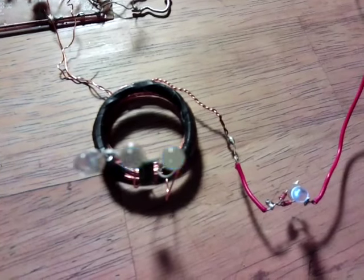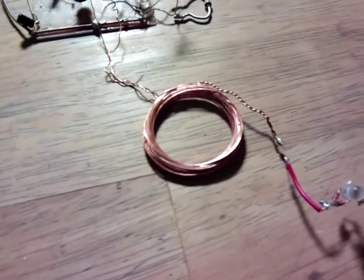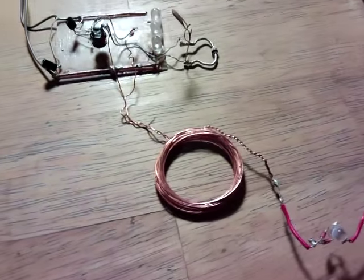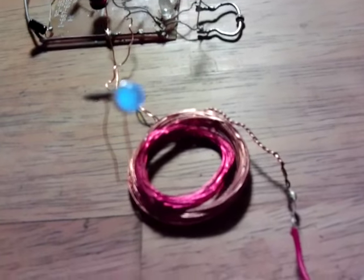It looks like a solid light, and that one brightens up. You can try out different coils — this one here is 24 turns of 22 or 24 gauge wire. Here's another one which was trying different capacitors; I think that's a 102 on there.